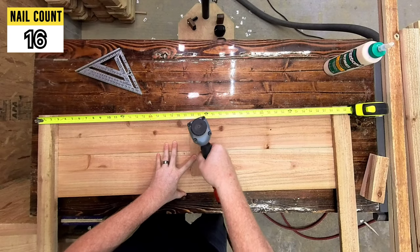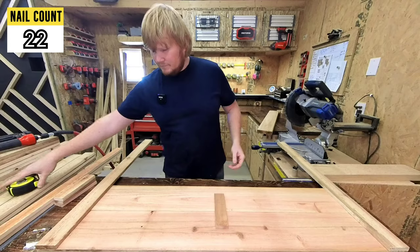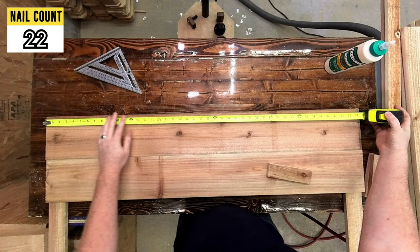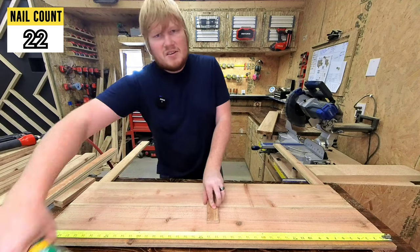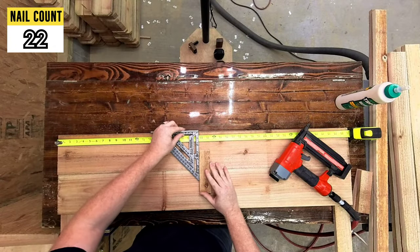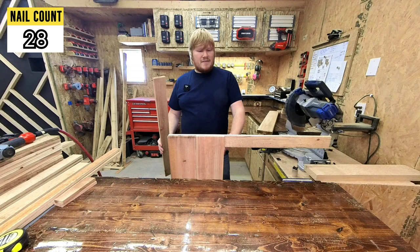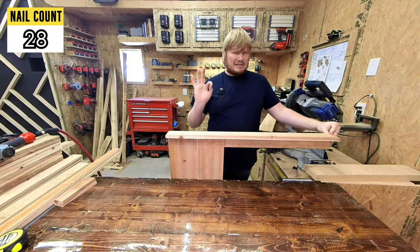With this entire assembly done we're going to flip it over and put our other bracing piece on the inside. Again, 45 inches is 22 and a half — it just sits like that. If it's not perfectly centered it's okay. Some glue, squirt them down, check to make sure it's not off-kilter. I like to have the leg facing me so that when I put the next leg on I can see where the edge lines up with the face of the board on my side, just to make sure everything is looking good.